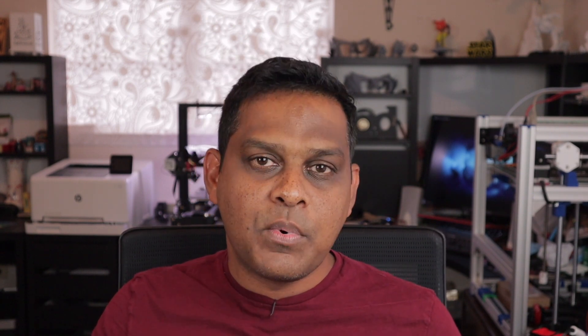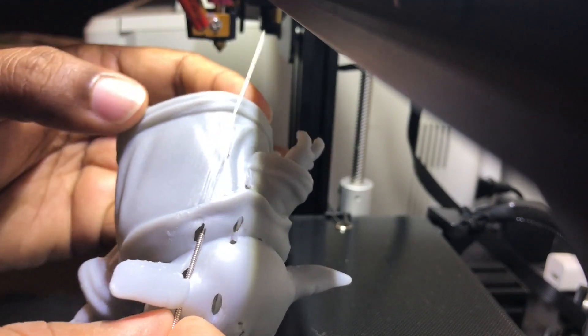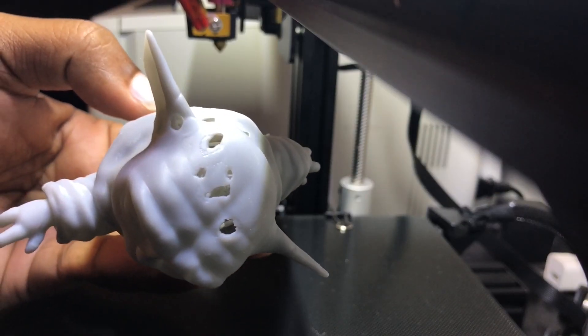Another way is when you run a test on your LCD and see areas where the pixels do not light up. These leave large holes in your mask, and in those areas the resin does not cure. You'll find that you have a print with an area that runs entirely through it, and if you hold your print up against the light you could look straight through to the other side. What has happened is that area on your LCD is completely off, blocking any UV light from reaching the vat — so that particular area on your build plate will never receive UV light, leaving a hole straight through your model.